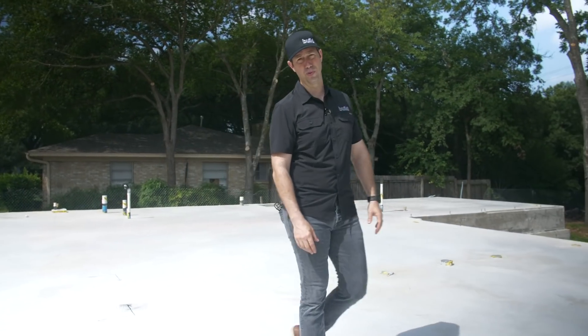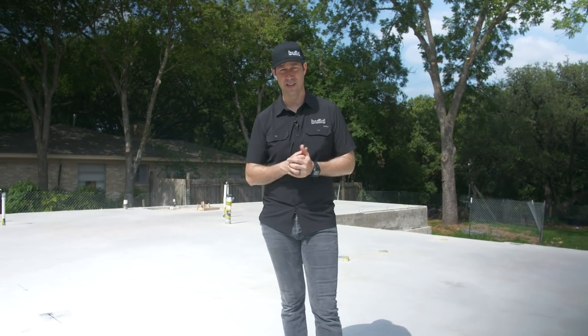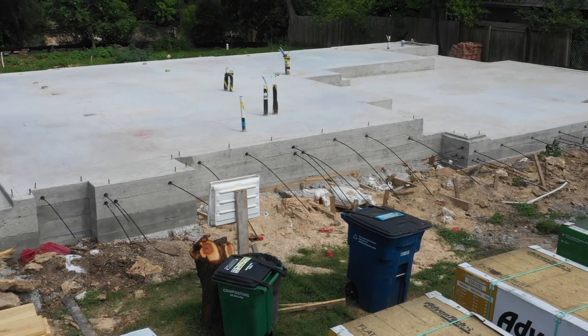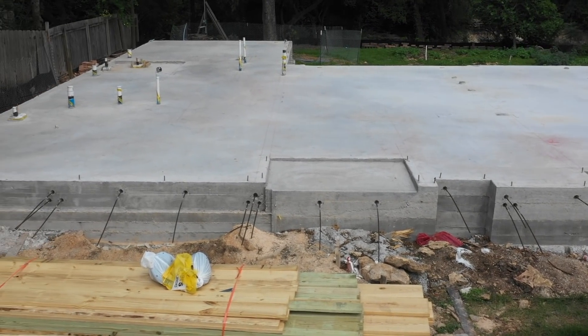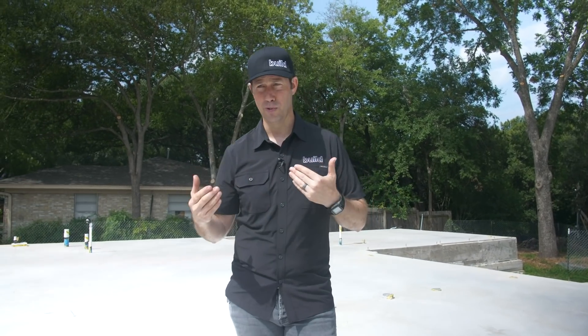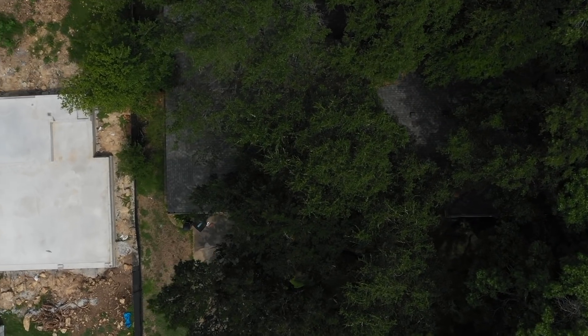Those cracks, even after tensioning, will still be there — they're not going to go away. But unless we have a finished concrete slab that's going to get stained or polished in the future, you're never going to see that. When you put tile over top of this, or if you do hardwoods later, you're never going to see it. And it's probably not going to move more than it already has. That's actually the big reason why people typically say they're looking for post-tension slabs instead of a standard rebar slab. The other reason is they're traditionally a little less expensive — rebar has gone up in cost big time. Depending on politics, sometimes there are imports on steel, tariffs, and things like that. There's literally several tons of steel that go into a foundation of this size, so reducing rebar and going with post-tensioning is definitely a cost benefit.